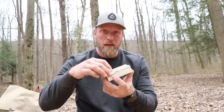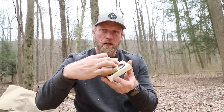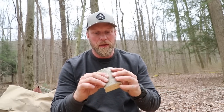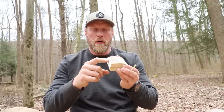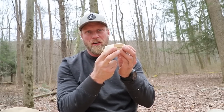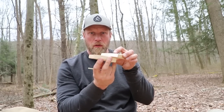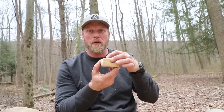We're going to fix that - we're going to put a little pin so this thing just rotates open and closed on the pin, and we will be set to go. The box is green wood, so we know there's going to be some shrinkage. So I want to use a dry stick - something that is not green. The reason for that is the stick will stay the same size, and once it's inserted on the hinge of the box and the box starts to dry, it will lock the stick in place. We should still be able to do the hinge action, but we won't be able to pull it apart - so it's going to work out perfect as it ages.